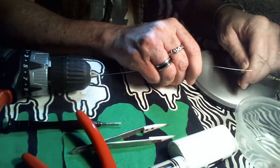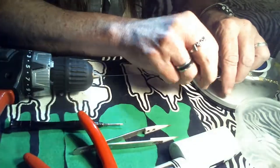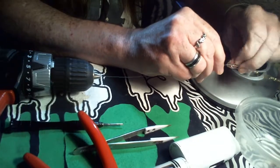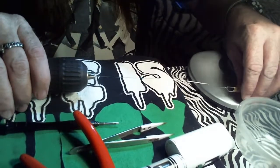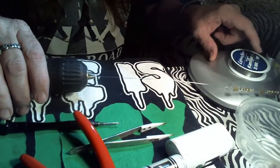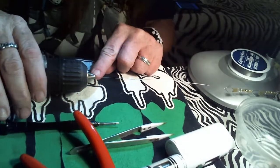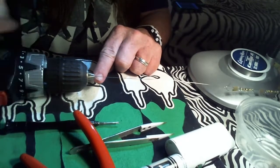On the other end, we're going to take and stick it through a swivel. Bring it over, tighten it up a little bit, and just squeeze on the end real good. Just bend it back a little bit — that way you know it ain't going nowhere. Now pull your drill top a little bit — tight, but not too tight. Because when you start to spin this, you're going to be pulling with your other spool, putting tension on this wire. When you put too much tension, it'll start twisting right at your chuck and it'll break on you. So you got to be careful.